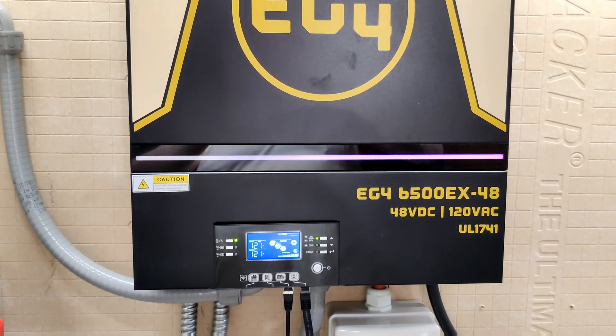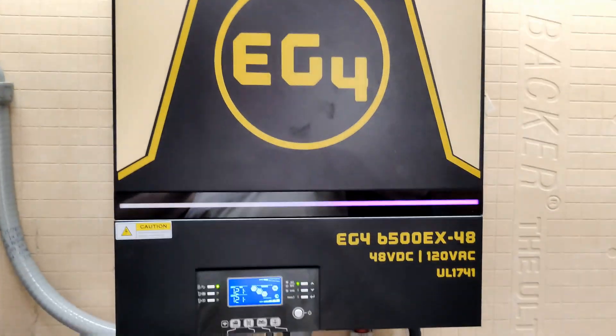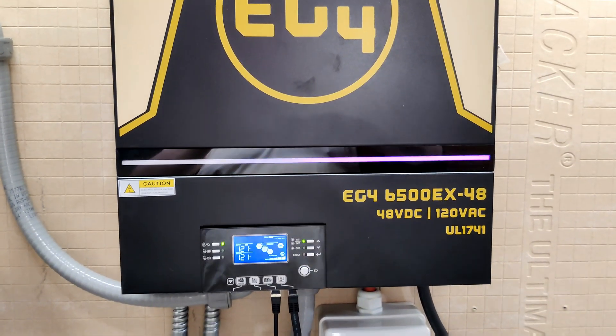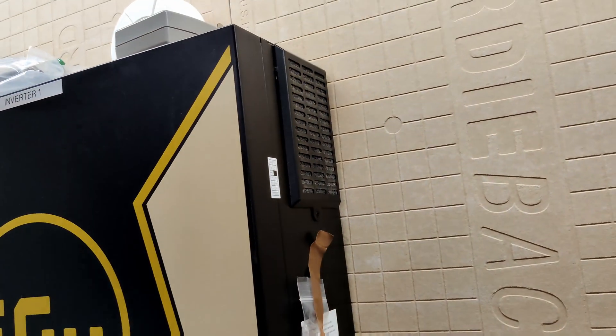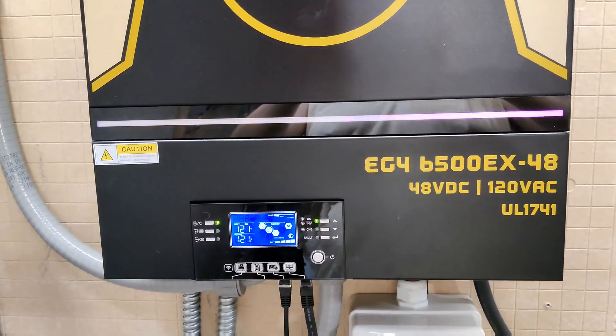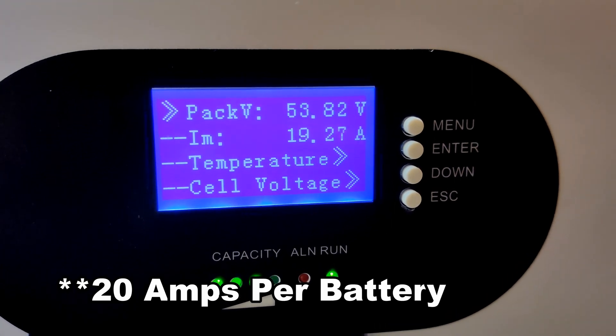She's all wired up. Now we've got her flipped on. We've got 122 volts coming from the grid into the inverter. And now, if I want to charge from the grid, I can charge at 40 amps instead of 20 amps because I don't have to worry about popping the breaker when charging those two batteries over there. That will be nice, especially since the weather is going to crap and I'm having to use grid charging a lot more, so this will be a nice upgrade. Grid charging at 40 amps from a single inverter makes the inverter sound like it's going to explode or something. Charging at about 20 amps.